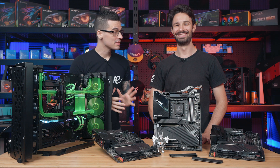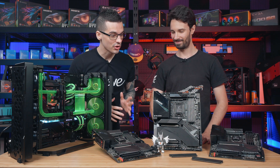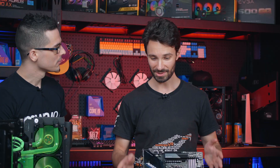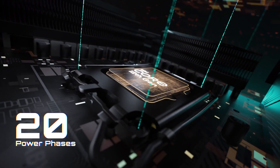Alright, so we haven't seen a Z690 motherboard on the channel Alex, so you get to be the first to tell us about it. The first thing I notice is it's obviously covered in armor, which looks cool, and I think there are 19 VRMs on this board. Yeah, so I guess we'll talk about the VRM first. With Z690 we've actually built some of the strongest VRM we've ever put together on a motherboard. You've got up to 20 phases of power, 105 amps each phase.